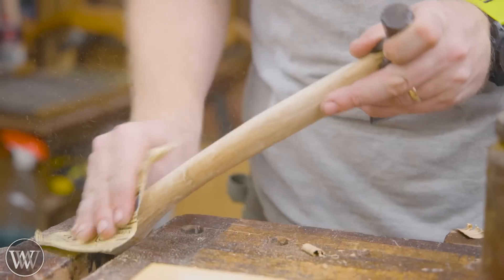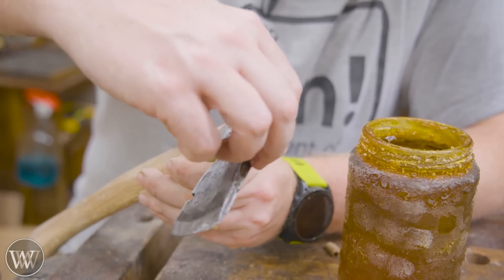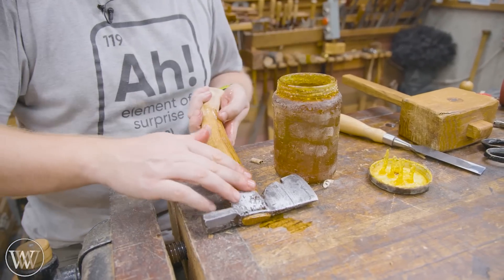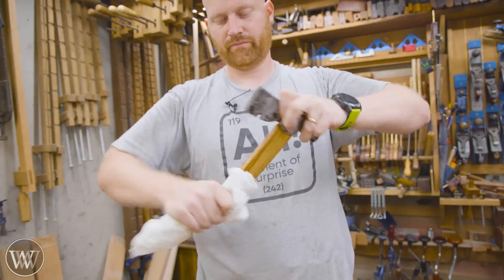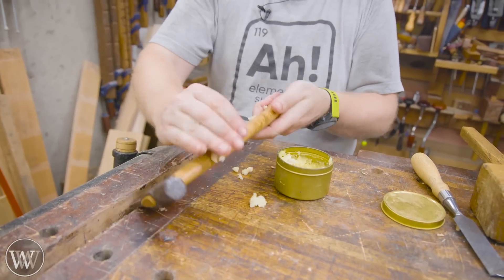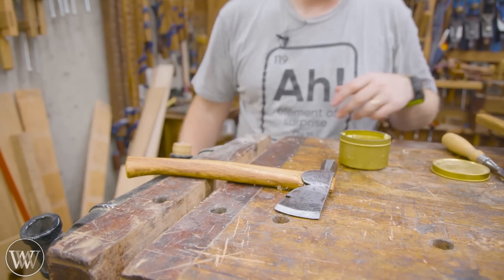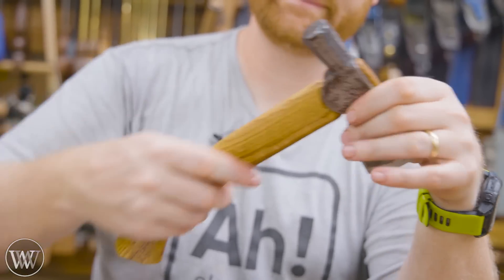For the last bit, because we're going to be hitting it with boiled linseed oil soon, I'll hit it with some 400 grit sandpaper — something very fine. What this does is fill all the pores with dust, which wicks the oil in a little bit deeper. I've got a couple of videos showing that under the microscope. I love this point where the oil goes in and the wood just comes to life — absolutely beautiful, especially with this wild grain white oak. We're going to let the oil soak in, several coats every 15 minutes or so. Then we wipe off excess and rub in paste wax — stuff I make myself. We let it sit for 30 to 45 minutes, then polish off anything left on the surface. It gives an amazing feel and a little bit of protection.